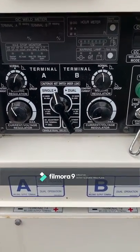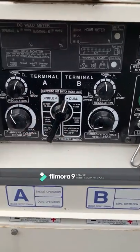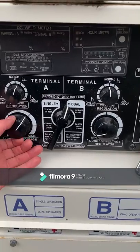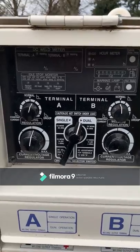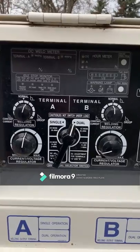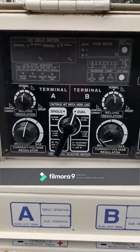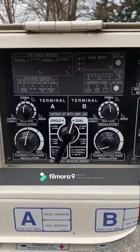On single, you can use this up to a max of 400 amps. Flip it over to dual and each operator will have a maximum of 200 amps at their disposal. You regulate the amperage or voltage with this knob. Also unique to Multiquip is a welding regulation feature that helps you control the arc length, so depending on what material you are welding you can fine-tune the length and strength of your arc to lay the best welds.